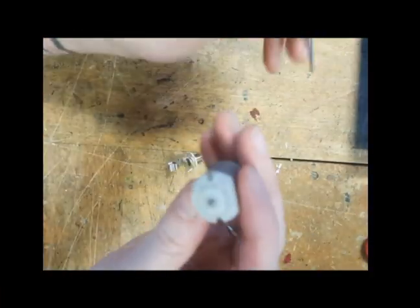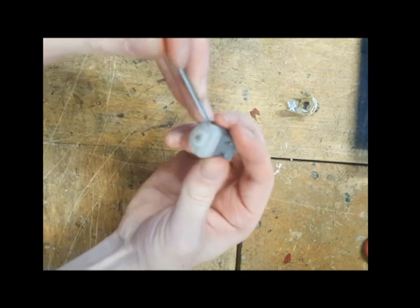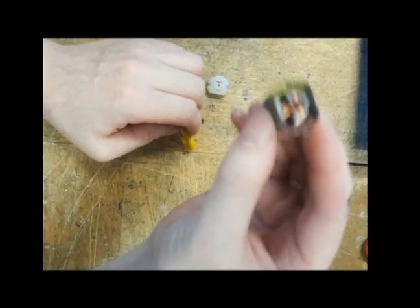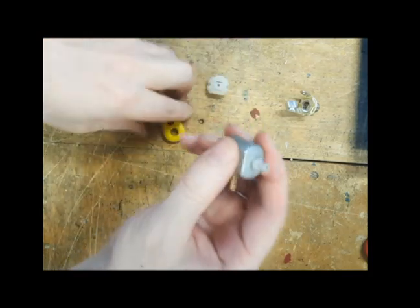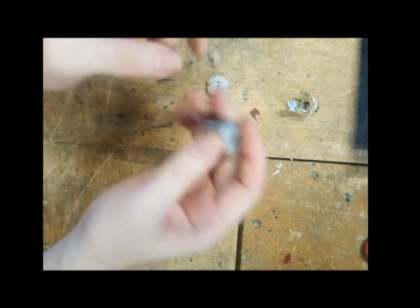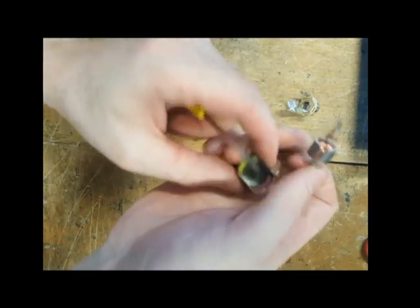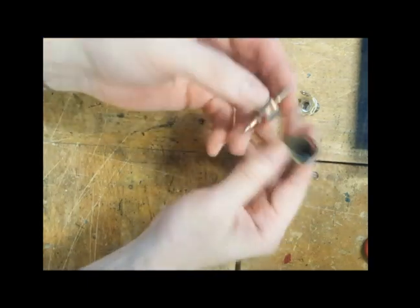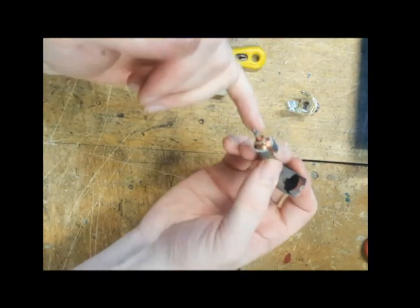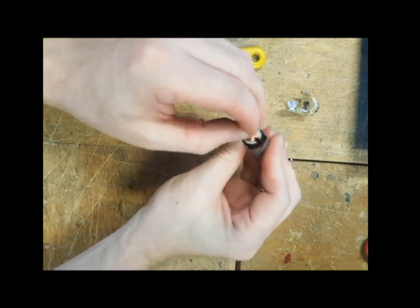If I take this one apart — here's our motor, a very common element. Inside you'll see it's basically coils of wire, and inside the motor we have two magnets. So with motors, when you put a current inside, the coil will start to move because you've got a coil of wire and a magnetic field. So that means this motor could also be used as a pickup. If I were to drill a hole in this chassis and then connect up the two pins to a jack — which is what we use to connect guitar cables to — then that would become a pickup.